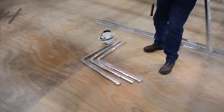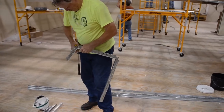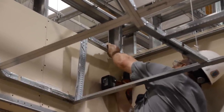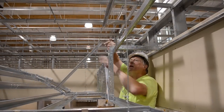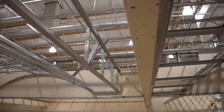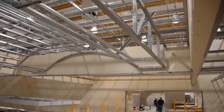We are going to kick back to structure every four feet on that one long side, then return to the wall with a 90-degree pocket. These 90-degree bent pieces can be spaced as far as four feet apart, which means less bending time for you. If any of the vertical or horizontal runs of your pocket are greater than 24 inches, just stab a 48-inch cross tee perpendicular to your bent tees and space those 48-inch tees on 24-inch centers.